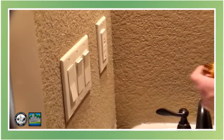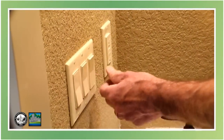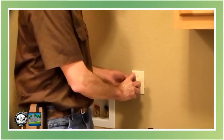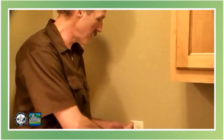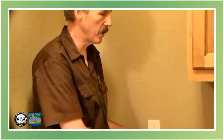Okay, we're in the little hallway half bath here. It also has washer and dryer in here. Over here, we have a receptacle next to the sink, and that's got the GFI on it. We'll check that — it tripped, okay. Overhead light, fan — that's good. Over here, we have a receptacle for the washing machine. Because it's in the bathroom, it has to be ground fault circuit interrupter. It is not tripping when tested, so we'll have to write that as a correction too. Inside a bathroom, all receptacles have to be on a GFCI.